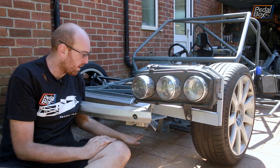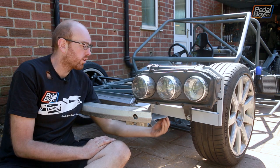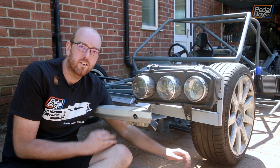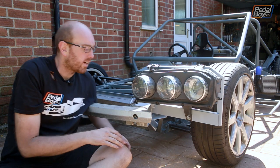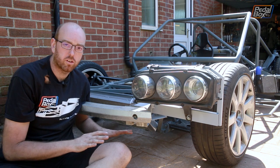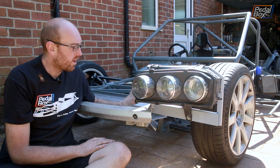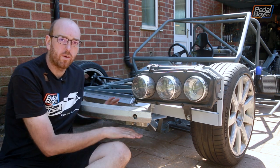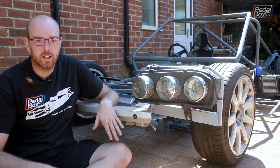So we're going to have to mount it some way. We need a reasonably strong mount about halfway down, so I'm going to build something onto the radiator mount which will come down and also come across to the outside edge of where the wheel is, for the arch to join up and for the bodywork at the side to really mount onto something securely. Anything we put forward of that we're still going to try and make as lightweight as possible, so I'm going to limit my use of inch box to only behind this line.